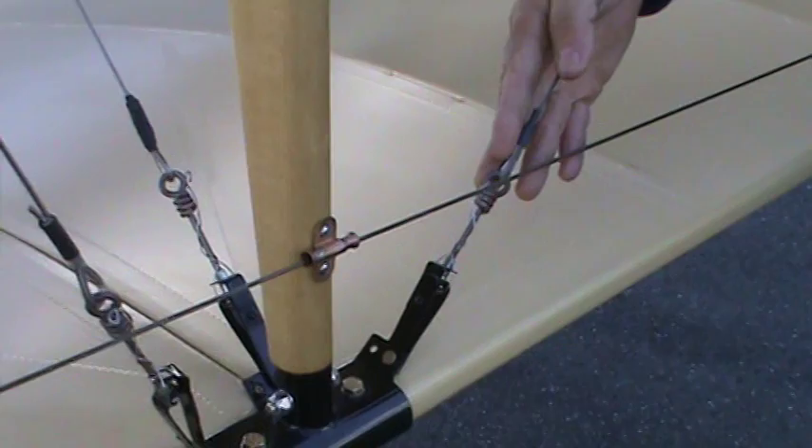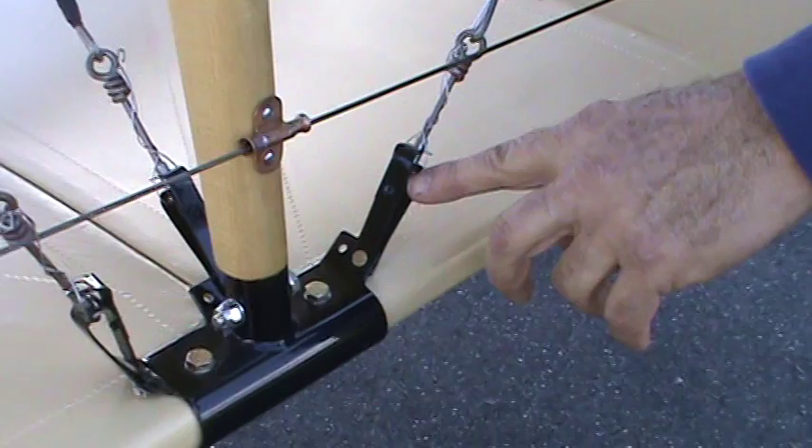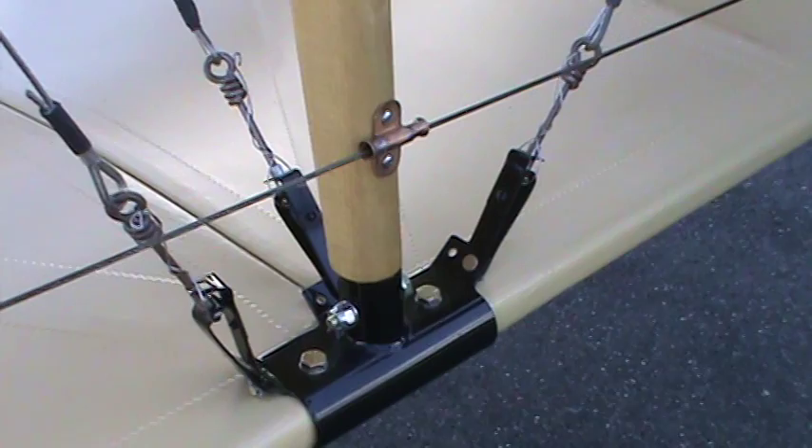Were they built to length or do they have turnbuckles? They do have turnbuckles, and we have gone so far as to replicate the exact turnbuckle that Glenn Curtis used on all of his Curtis pushers. It consists of a metal strap, a motorcycle spoke, a motorcycle spoke nipple, and then a motorcycle spoke that has been shortened and turned into a ferrule. This is exactly the way they looked when Glenn Curtis made these over 100 years ago.